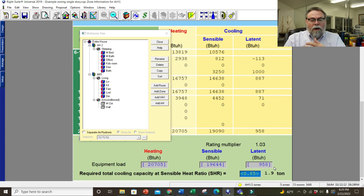Could I get away with a one-and-a-half ton? If I bump up the sensible heat ratio to 0.92 and hit enter — no, I can't quite get a one-and-a-half ton. This is a heat pump, so we need the heat side too. On the heat side I need 20,000 BTUs. So I'm going to leave it at 0.85 and probably put supplemental heat strips in — on colder days they'll kick in. Checking H2 at 0.85 — it also shows two tons. Even at 0.92 we're at 1.8 tons, so we're better off leaving it at 0.85 because you need that extra heat.